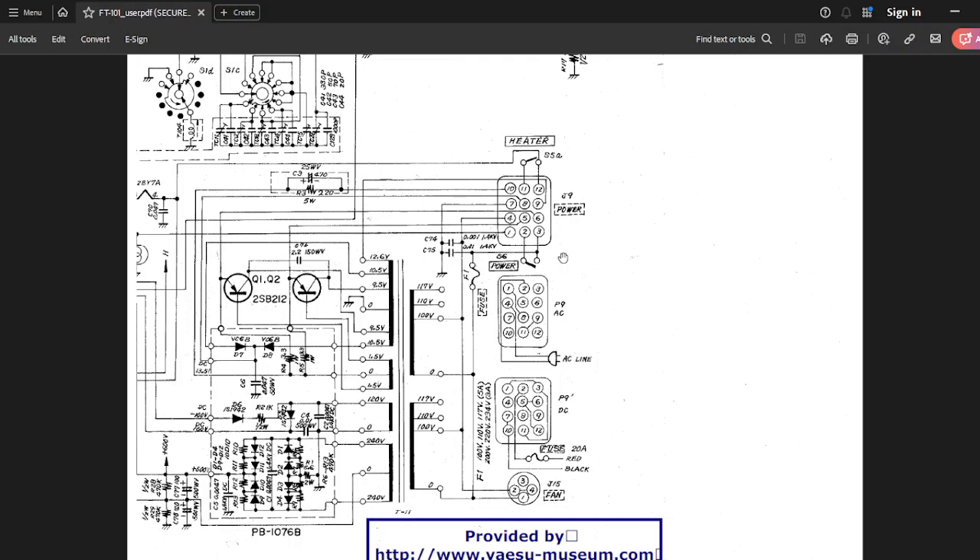So I got to thinking — there's one other way you could do this. If you're putting a connector on and you accidentally wired these two backwards: remember, as long as the power cable is plugged in, number two has power on it. If you take the wire that's supposed to go to three and put it on two, and the one that's supposed to go on two and put it on three, then with power on two that wire is going to have power on it all the time. The switch is just hanging out there decorating the front of the radio at that point.